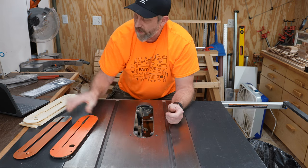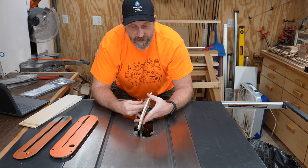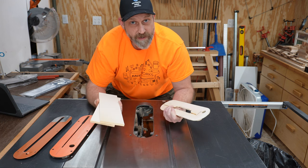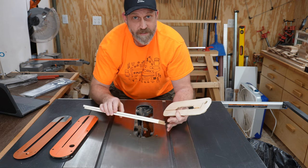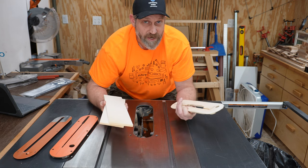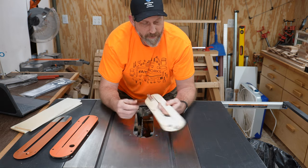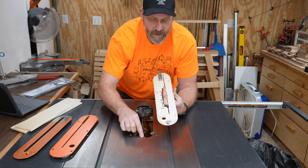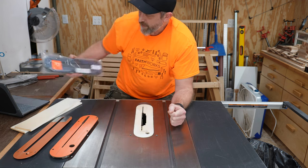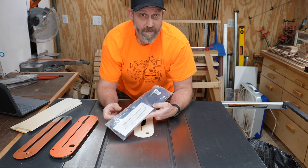Before I bought the aftermarket plate, I actually made my own zero clearance plates. This one ended up being for dados and is made out of PVC. You can flatten out a PVC tube in the oven — just cut it to length, make one cut down one edge of the tube, and as you heat it slowly in the oven you can flatten it out. This one has a tab on the back and I put a washer on the front because there's a magnet up here to help hold it down. I also have another aftermarket throat plate from LeeCraft for dados, but I forgot I even had it until I started making this video.